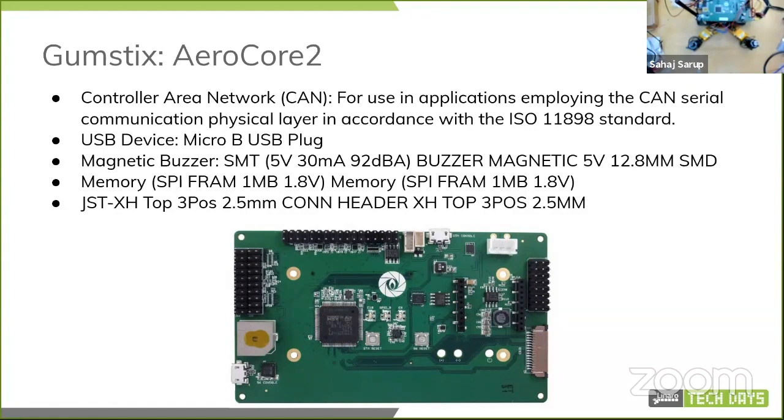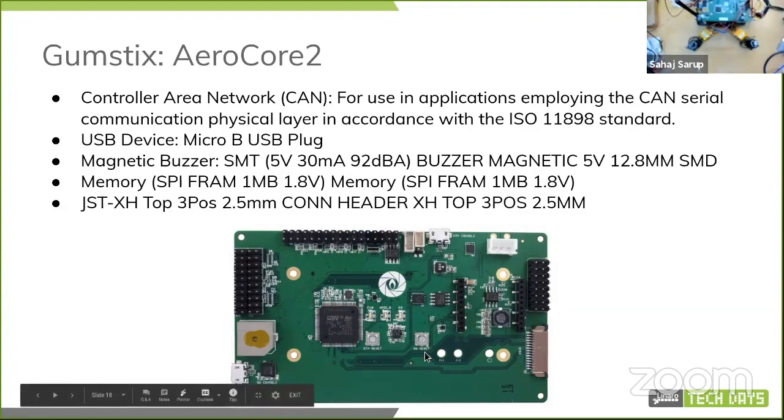Apart from that, there are 8 headers for PWM, which originally in the PX4 firmware were used for PWM out, and there were headers that were used for PWM in, to take control input from the analog receiver that's usually used on drones, so that you can use those big fat drone controllers. And then you have a bunch of communication headers, including multiple I2C, UARTs and SPI. And then there's an SPI switch that connects to multiple SPI devices as well. So yeah, a bunch of drone-focused things.